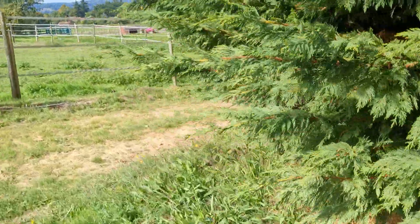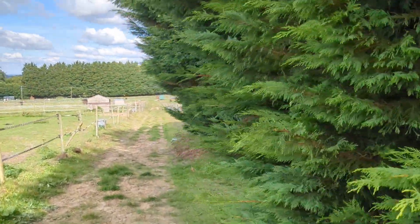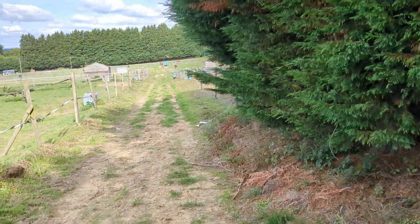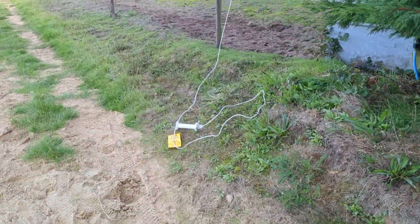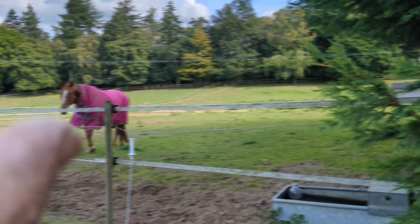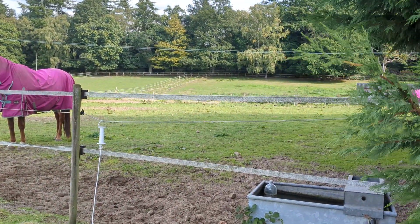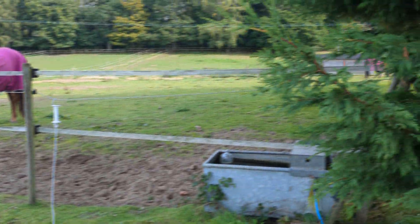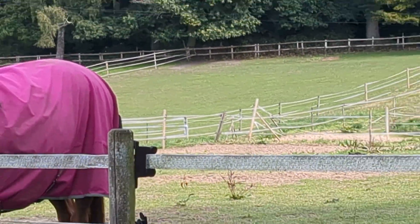We've got an energizer here that's been killed by a lightning strike and we're trying to work around that, but we've got a problem on this side — there is an earth short somewhere. What we've done is jumped it over using conductive handles. This means that this side is still pumping out 10kV, but when we connect it on this side it draws that down to 3kV. So by taking this off, we can see it jumps back up to 10kV, telling us we've got a problem over here.